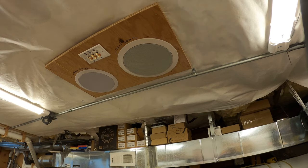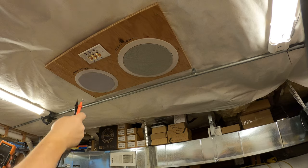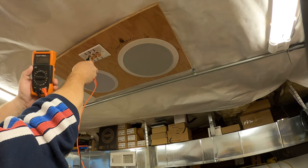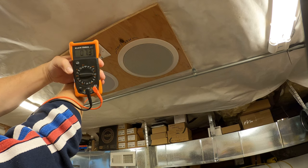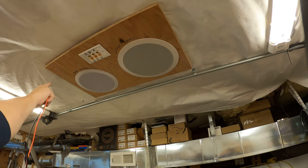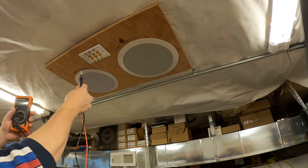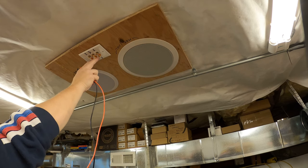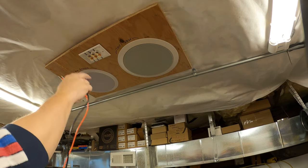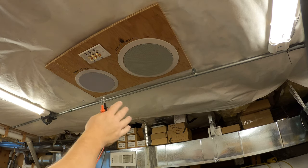On the home stereo side, you're going to want to set the multimeter to the 200 ohm setting, then take your positive and negative leads. It's showing 7.3, 7.4 ohms — so that's an 8-ohm speaker. A lot of speakers aren't going to be exactly dead on 8 ohms; they'll read 6.7, 7.2, 7.9. Now if we add two of these together in parallel, that's going to give you a 4-ohm load — basic Ohm's law. If I were to tie both speakers together, I take 7.3 and divide that, giving me 3.6 or 3.7 ohms, which is 4 ohms.